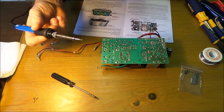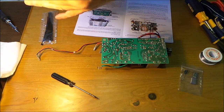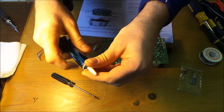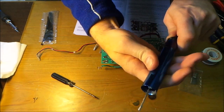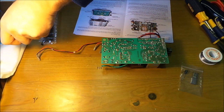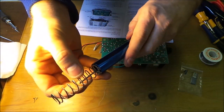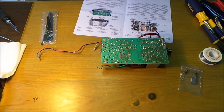Now the pump has got blocked, so what we do is unscrew it. If I can unscrew it, hang on, there we go. Unscrew it, and you'll see all the solder come in. What's happened is the solder has got round the central thing, and you just get a screwdriver, knock it off, there you go, and it comes off. Put the spring back in and re-screw it back up. Make sure it's screwed in right, because it's got to create a vacuum. Test it.